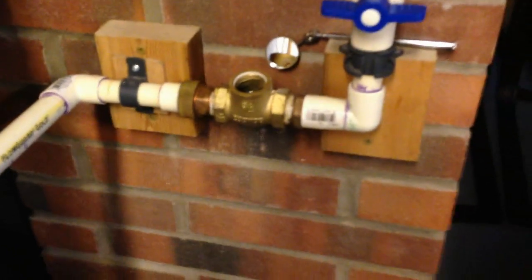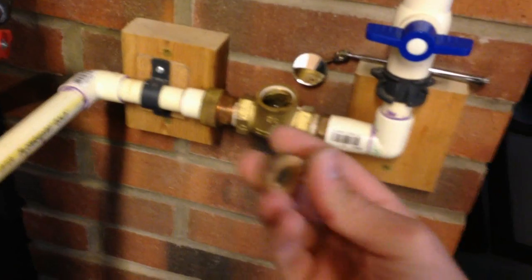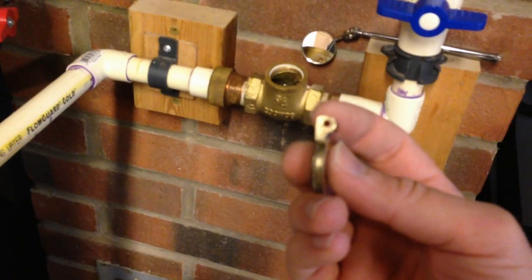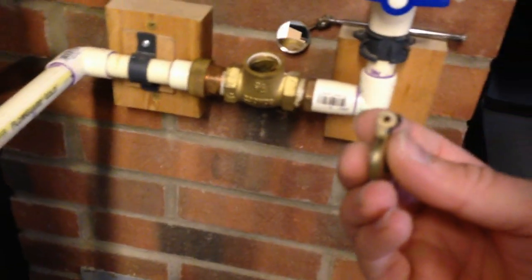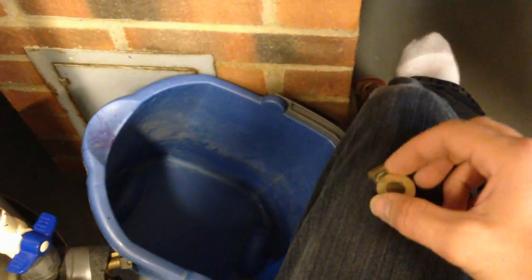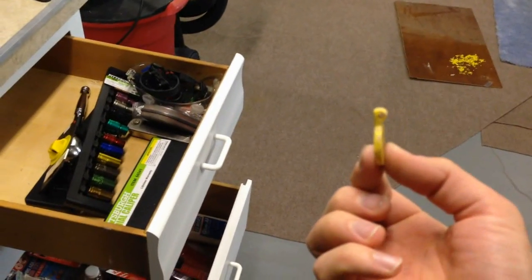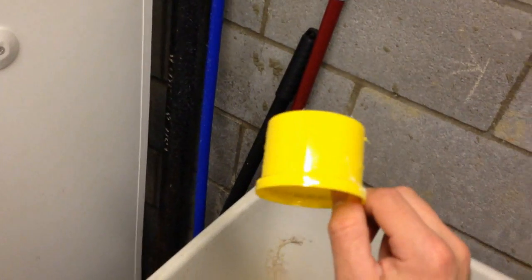The purpose of this video is to show that this flap valve is not sufficient for a hot water return line because of what it does. I've reamed out the hole a bit bigger and filed things down, but I'm just not going to deal with it — I'll keep it just in case. However, I made a mold and made a plastic flap valve — basically an exact copy. You can see it on the floor over there. It started as one of these caps off a Great Stuff foam can.